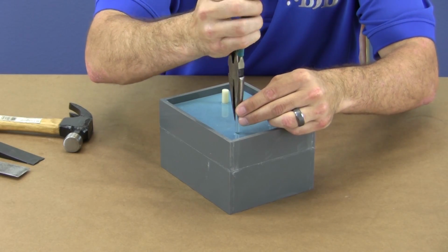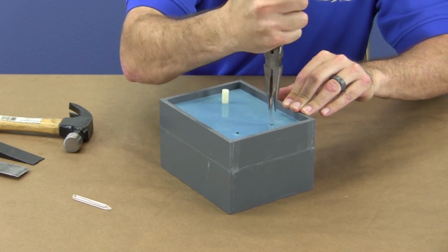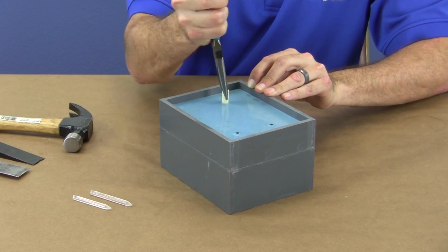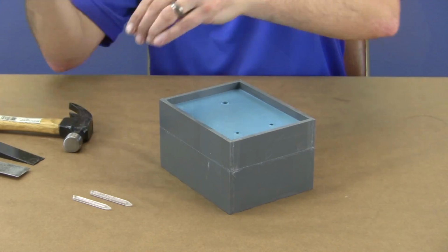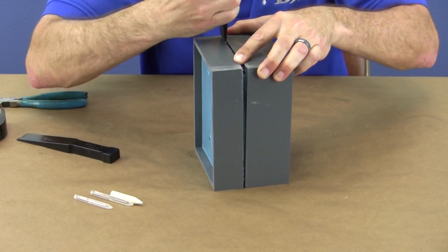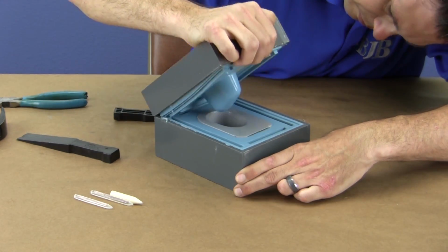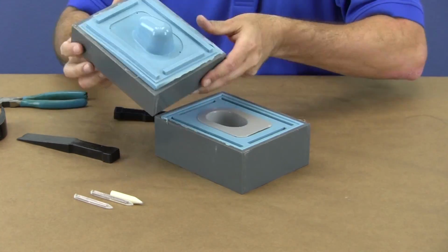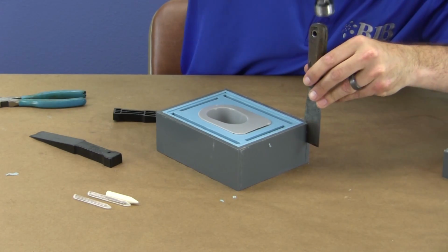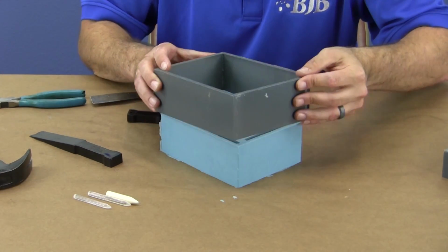After the silicone is cured overnight, we begin the process of removing the vents and fill ports. A twisting action and a light pull upward releases them with little effort. Using a plastic wedge, I slowly force the two halves apart. Once the majority of the surface is loosened, I manually pull it apart the rest of the way. I remove the lower ABS mold box by splitting one corner and working it free from the silicone.